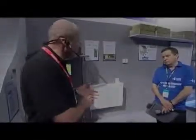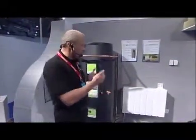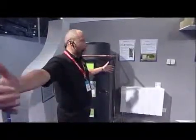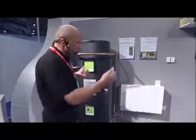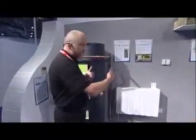After the product, we need to run it at a low water flow temperature. As we reduce flow temperatures within the heat pump system, its efficiency increases. For every one kilowatt of electrical energy you'll get more heating energy into the system. If we were to run a standard radiator at 35 degrees Celsius it becomes more like a wall space heater — it can be up to 6.8 times its physical capacity to meet the heat loss from that room. So by introducing other types of heating systems, the physical dimensions and size of those units come down.